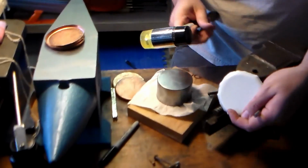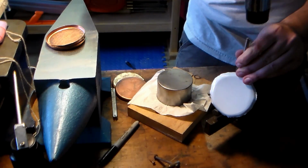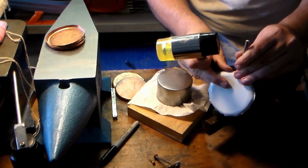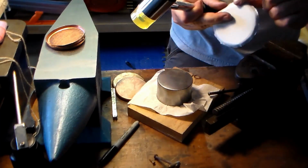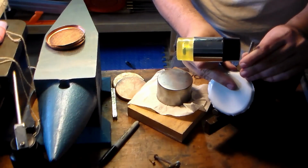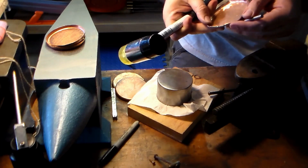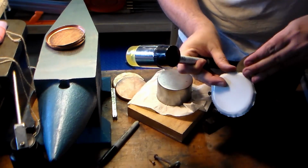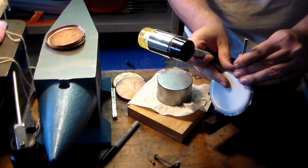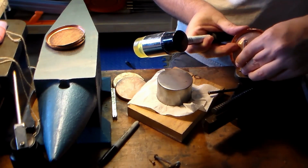Around, use the horn, come in here and go like, okay, I really want that spot down a little. And this is how I take care of the really persistent ripples. Yeah, that's better. Here's another one that's getting pretty bad. That one really needs to be taken care of before I move on. And I can work it from both sides.